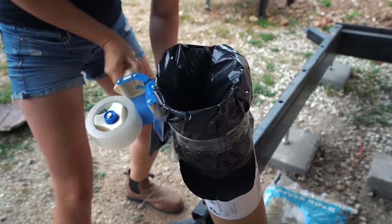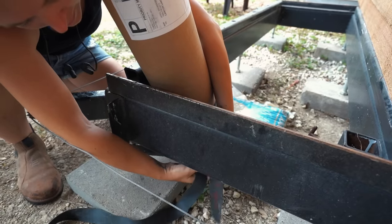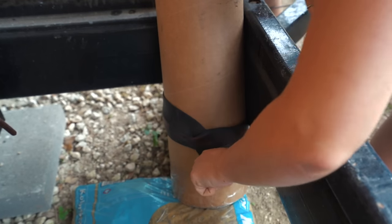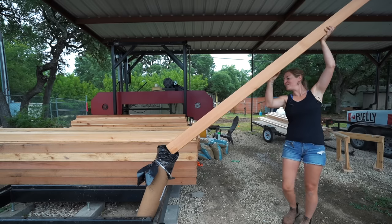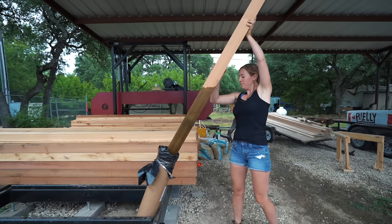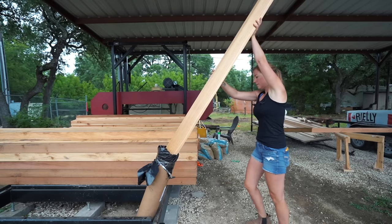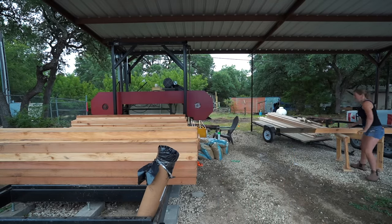To speed up this process I grabbed a cardboard tube and lined it with a heavy-duty trash bag, then used a simple strap to secure it at an angle to the bandsaw mill's bed. Simple straps are stretchy and can conform to any tying pattern — just a few quick wraps, tuck the end into itself, and then I was ready to go. I poured two gallons into the tube and then grabbed the first post and set it in gently, making sure the corner wouldn't tear open the liner. You can see when I pull it out that about three feet of the post is covered. If you can tolerate the shoulder workout, I definitely think a dipping method is better than brushing or rolling on the liquid. Western Red Cedar is extremely light, so while it was a shoulder workout it really wasn't all that bad.